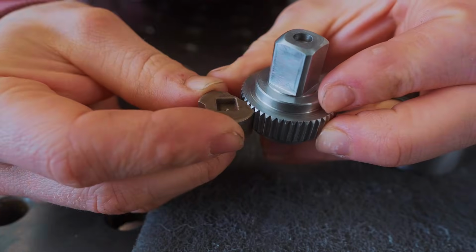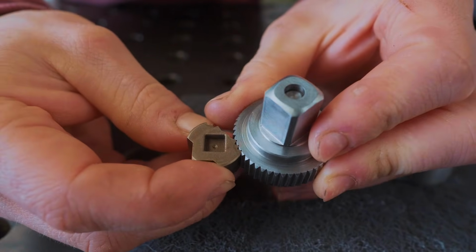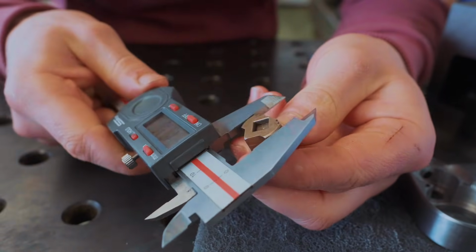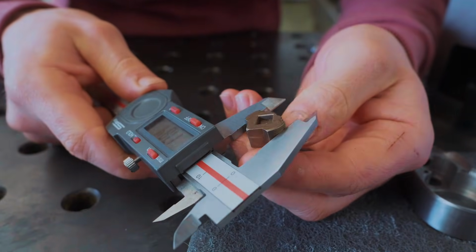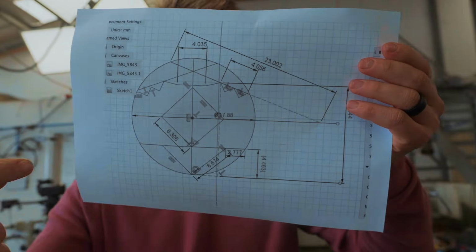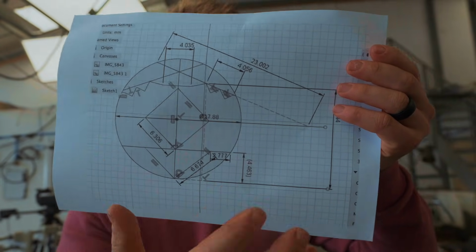Now there's clearly some very important geometries going on for this to work, fit, and be strong enough to not strip any teeth. With most of this project, I've just been able to use the calipers and measure parts up to know how I need to make it, but in this case, I went ahead and took a photo, imported it into Fusion 360, and on top of it sketched the actual part to dimension, and then was able to pull some dimensions off it, as well as the key angles. That information will mean that hopefully I can plan an order of operations to where this actually works.